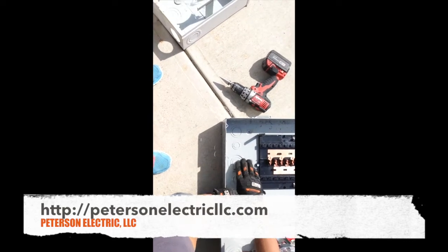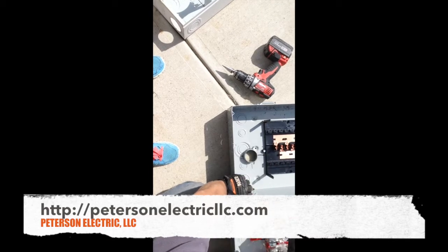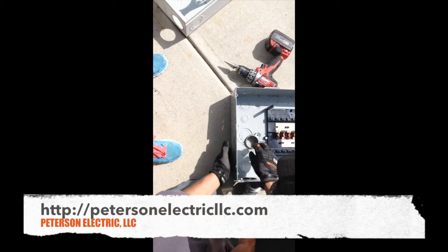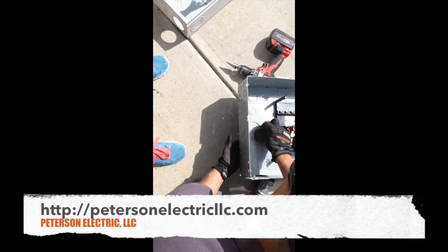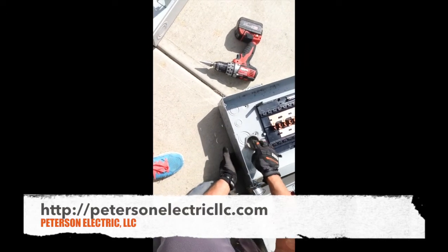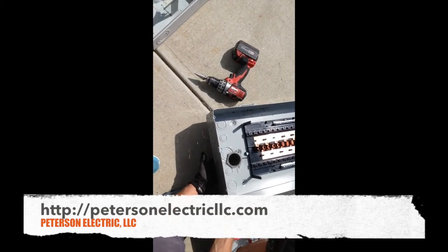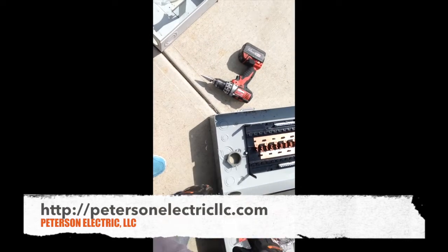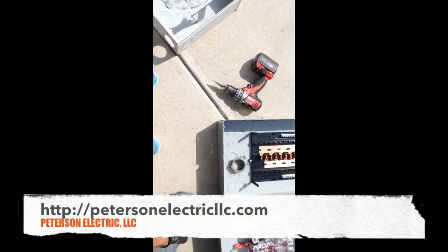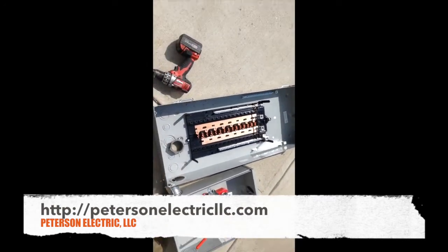This just has to have a bushing to protect your wires. Typically you don't need a bushing if anything is under a number four, but because we still have Romex and we want to protect it, we'll put a lock washer and a plastic bushing. Last thing you want to do is install the plastic bushing and have to undo everything just to get it on — so just appease your inspector. If you do it backwards it doesn't technically matter because this is a smooth side, but I take a picture when I meet my inspector so I can show him the bushing I put on.